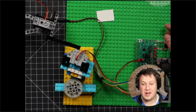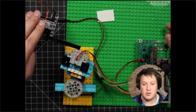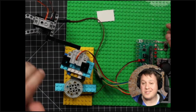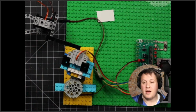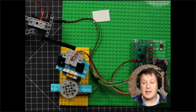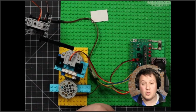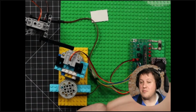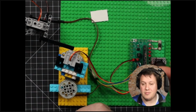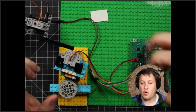We have another version we're working on, where instead of using a servo on the end here to open and close, we're going to use that servo to raise and lower a magnet that we will then control with the built-in relay on here. We got a little $5 electromagnet off of Amazon. We have a built-in relay on here, which is just a smart DC switch. Micro:bit can say turn on or turn off. That's basically all it can do. So that way we could pick up, say, metal pieces with that little electromagnet and move them around a table like a real robot arm would do.